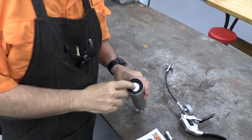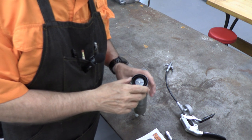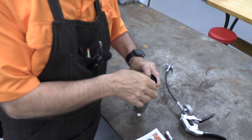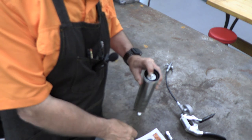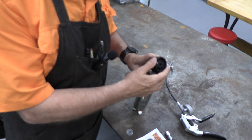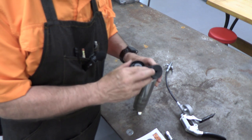These are held in place with either a nut or a cotter pin. This one's got a cotter pin — I've straightened it out. We'll push down on the washer, take the cotter pin out, take the washer out, take the plunger out, and then this — also known as the follower — we're going to take that out and save it.